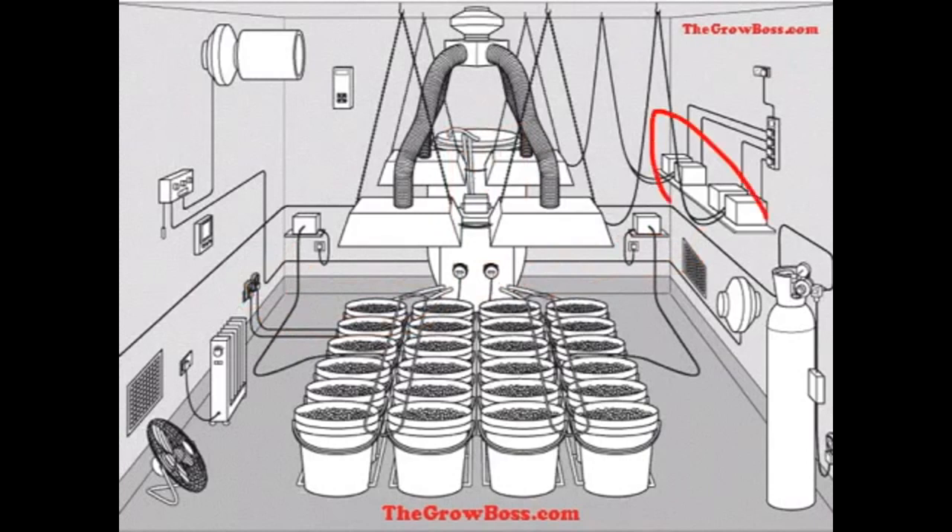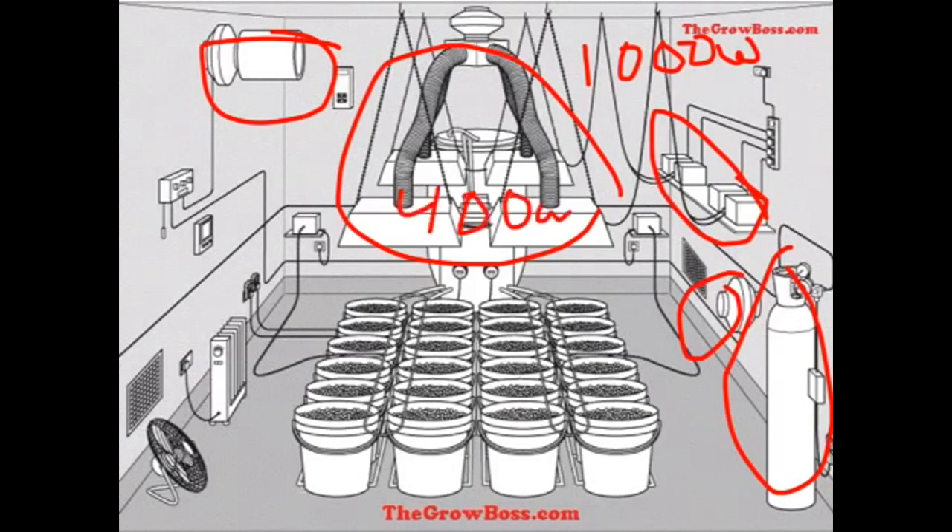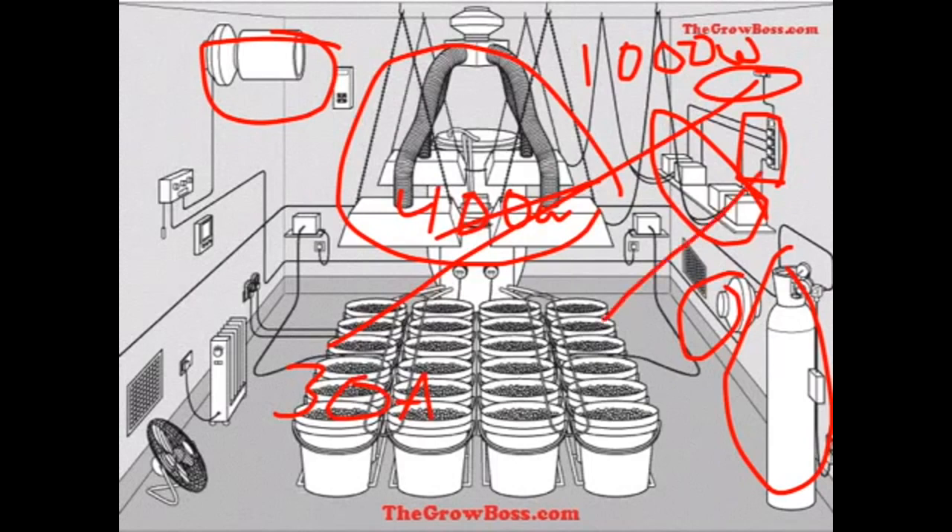Let's take a look at these ballasts. I would suspect that they're thousand-watt ballasts. Who goes through this much trouble — all this setup and this CO2 — if they're going to be like a 400 watt? Forget about it. That doesn't look too safe. That definitely does not look like a 30-amp outlet — it could be, I suppose. That just looks like a regular six-plug outlet. So I'm not sure, even if these were 400 watts each, that's 1600 watts worth of ballast on a 20-amp room.